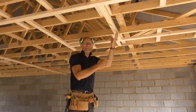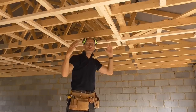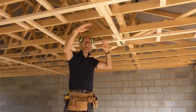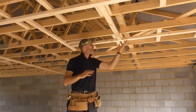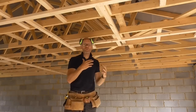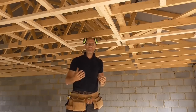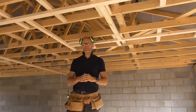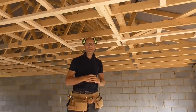Right, so that's all of these head plates up now. I just put a couple of extra little noggins here and there just to make sure that all the plasterboard and internal, external corners on the ceiling gets caught up. As I said, all of these intermediate noggins through here are all at 600, so there should be something on the end of each bit of plasterboard. If there isn't, for any reason, I'll have a quick walk around with the tackers, who are absolutely fantastic lads, and I can stick a little noggin in for them, no problem. I'm happy to help them out.